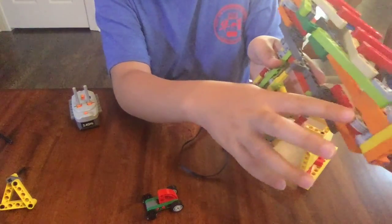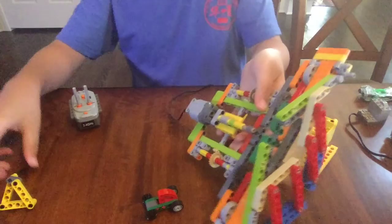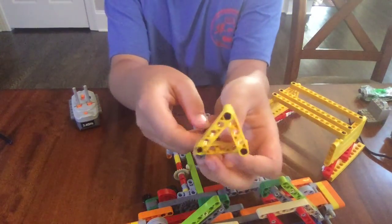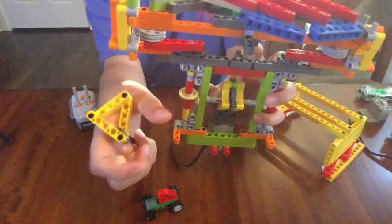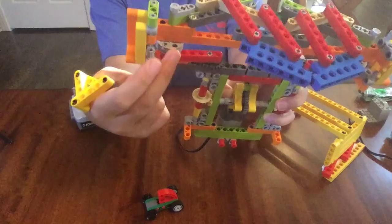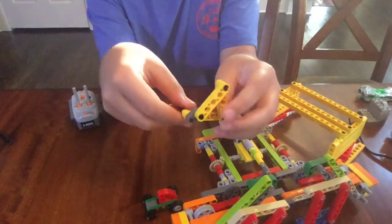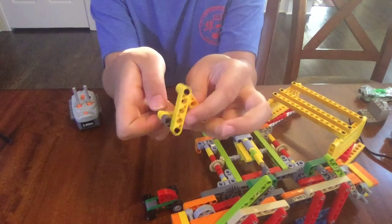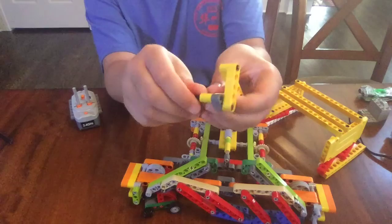The red bar, the wheel, and this green bar is an example of a four-bar linkage right here as a model. So the small gray bar right here is the crank. In this one, the 24-teeth gear is the crank. The red bar and the wheels — the bar connected to the crank — is the bar that you want to make a waving motion with. And the green bar right here makes the moving motion.